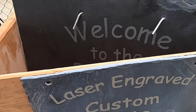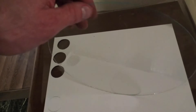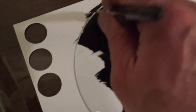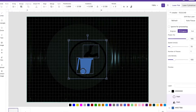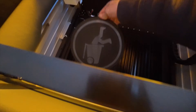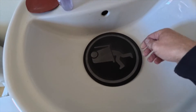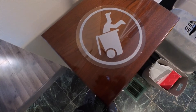I've shown you how this cuts and engraves paper, wood, stone, and slate. It can also etch glass, though this does require some preparation — you first need to obscure the glass. Some cheap tempera or acrylic paint seems to do the trick. The estimated time to complete the project is provided before you begin; this one came up as an hour, so I lowered the quality a bit and got it down to about half that time. When it's finished, the tempera paint easily washes off and you're left with a permanent quality glass etching. The finished product looks really good.